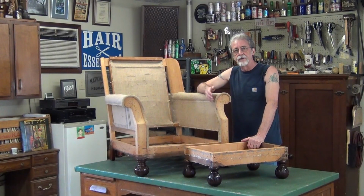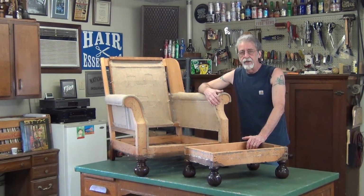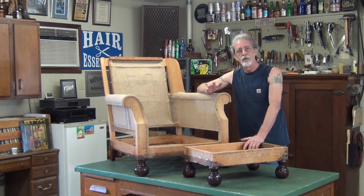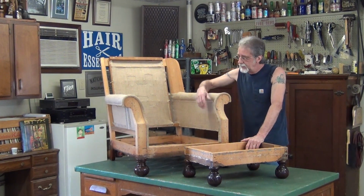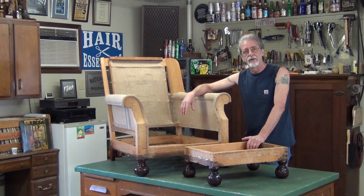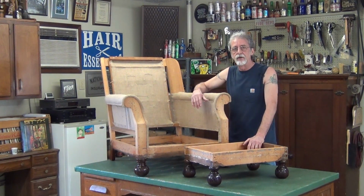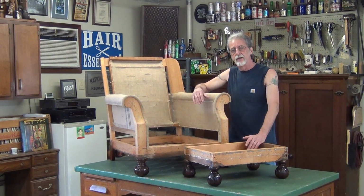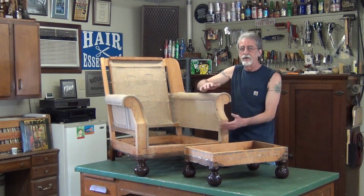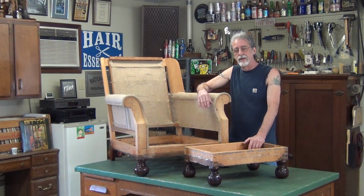I've been working on this chair and ottoman built around 1920, and it opened up the door to a subject matter I've wanted to cover for a long time. Typically, furniture from the 20s and Depression-era 30s had a steel that just didn't quite have the strong tension of today's steel, so spring heights didn't always translate the same with the old steel versus new steel.